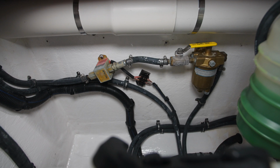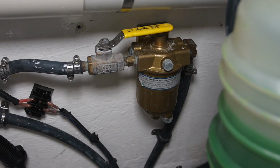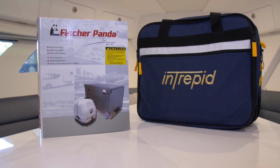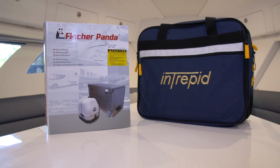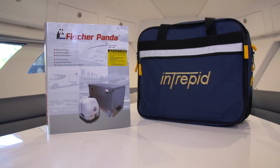There is a fuel filter mounted on the bulkhead on the starboard side of the generator compartment. This is the primary filter for the generator. There's a fuel isolation valve right next to it. When you change the filter, you'll want to close that valve. Please refer to your Fisher Panda Owner's Manual for complete details on its fuel system and operation.